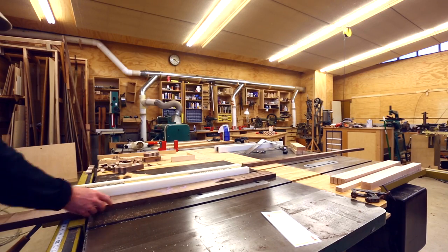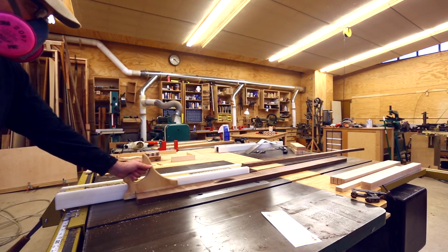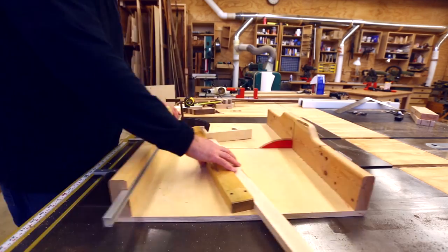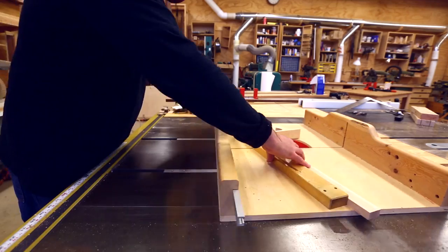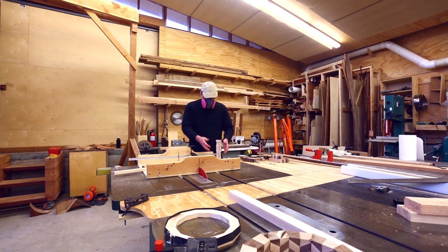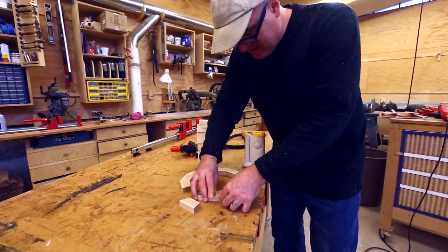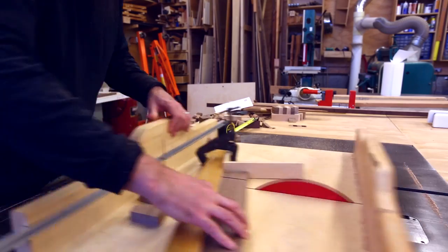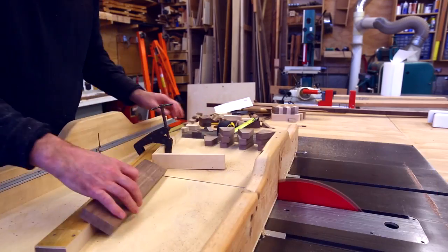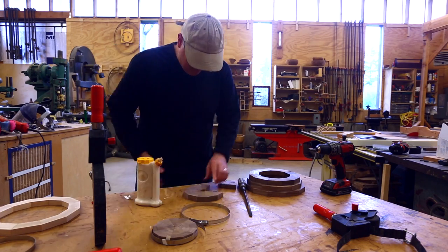Now to make the rings on the bottom and top of the bowl — these will just be simple segments that fit together to make rings. I'll cut a bunch of strips, then cut those strips into segments. The angle on the sled is the same 15 degrees as before, so this will also make 12 segments per ring. Those were the maple rings, then I'll cut pieces for the walnut rings. The one near the bottom is a little wider because the curve of the bowl needs that width. For the smaller rings I have some smaller hose clamps, which I find work really well.